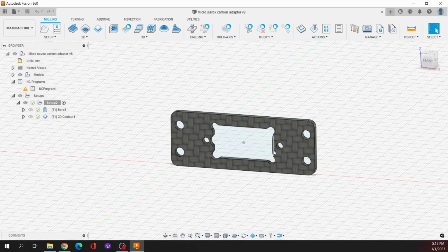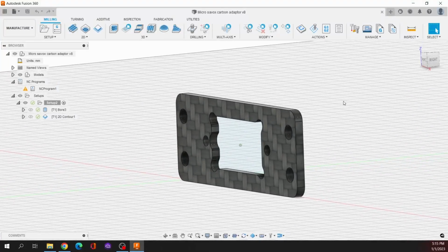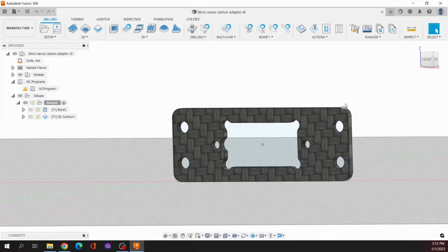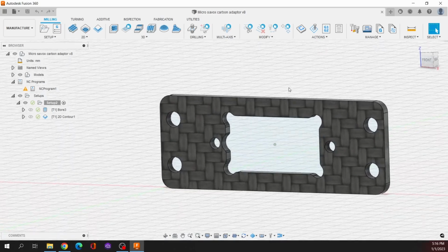to the other side. And this little part is an adapter bracket that we are going to machine from carbon fiber. The purpose of this bracket is that it takes the bolt pattern on the outside here, which is your standard servos, and I'll show you a couple of servos just now. This is your standard servo bolt pattern on the outside, and I'm adapting down to a little micro servo bolt pattern on the inside. The reason I'm doing this is there's very limited space inside this little 1/10th scale carbon fiber car. It is a Tamiya TT02 chassis, but a full carbon fiber one.